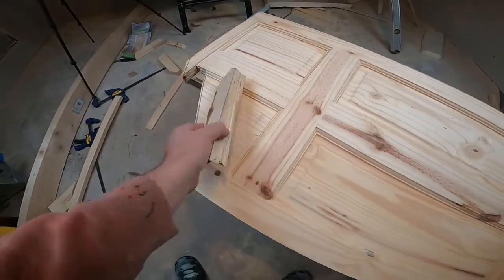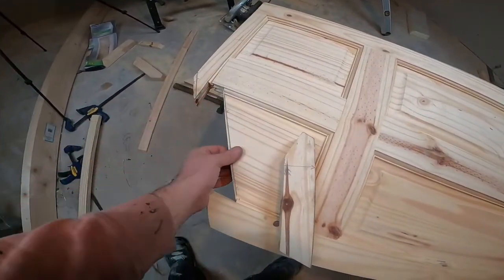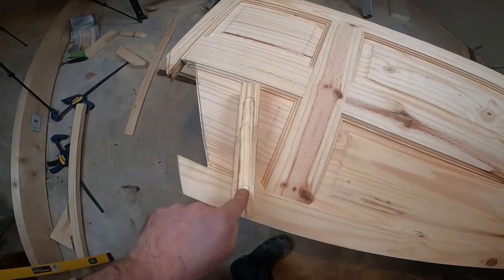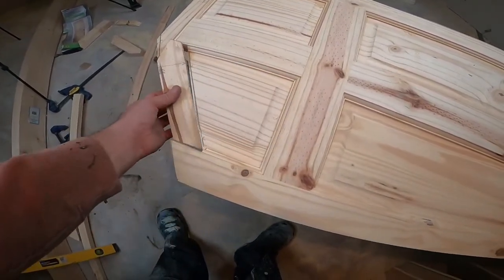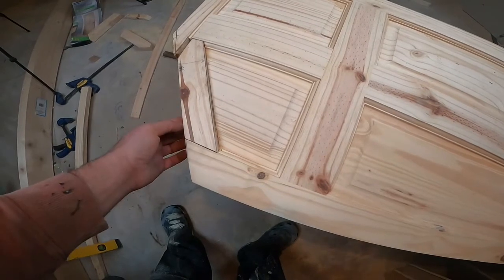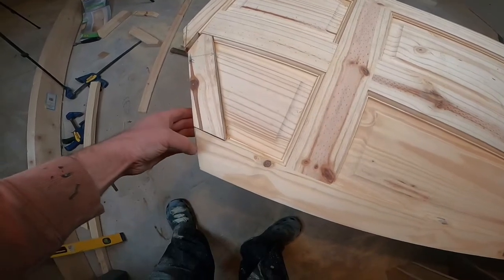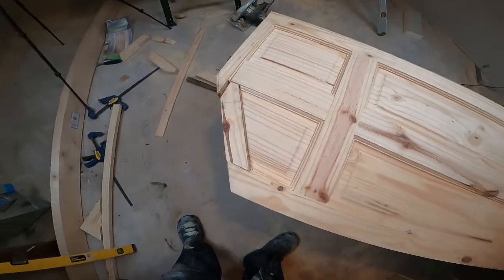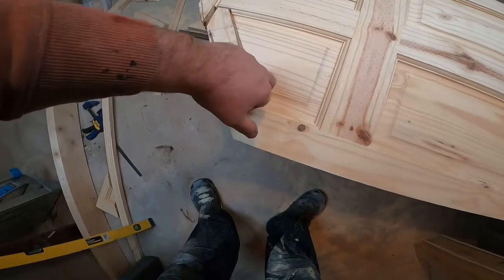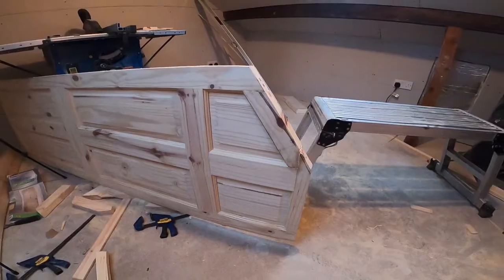What I've done now is cut the angle across my piece of wood. I managed to slide the infill out, cut it at an angle, and then routed the inside — that's going to go in there. I'll wood glue it and push it up so it should all fix together nicely. I'm going to put a screw across either side just to hold it all together. As you can see, that width there matches up nicely and with a little bit of filler and trim it should look nice.